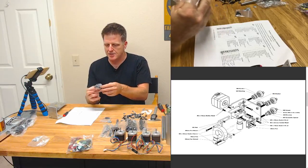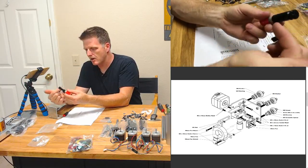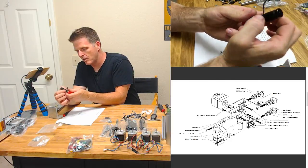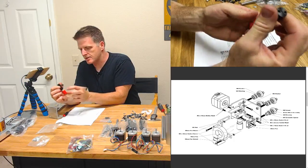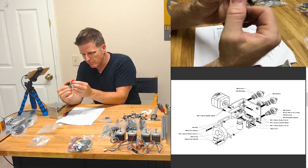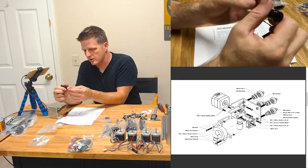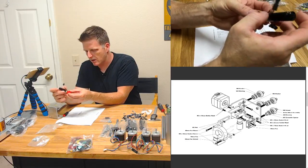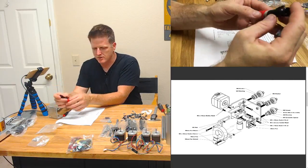So, if you haven't seen these UBIS hot ends before, they're pretty unique. You can see there's not a lot in the way of cooling fins, because it doesn't need to be. If you get Brooke going about why this is better than an E3D V6, he'll love to tell you all kinds of stuff. But it's a ceramic heater integrated, and then some copper. I'm not sure what we got going on under the insulation, but it's not a cartridge-based system like everybody else's. The windings are directly around the nozzle and the heat break. So I don't think I want to unscrew this, because as I recall there's Teflon and stuff in here that it would probably be bad if I started trying to take this thing apart. But anyway, that's the UBIS 13 HF.